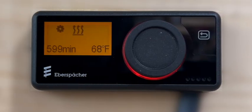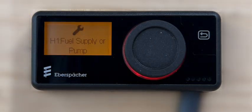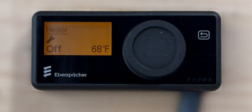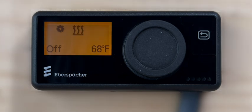In case of a heater fault event, the red colored LED ring around the control knob will begin to blink. The display will show the symbol of a wrench to indicate a heater fault event and a user level error message will be displayed. Pressing the control knob will switch off the red colored blinking LED ring and the display will show the heater's switched off status and the symbol of a wrench above it. Pressing the control knob a second time will revert the display back to the controller's default screen and the active fault condition of the heater will no longer be displayed.